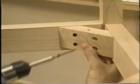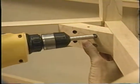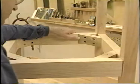I install the blocks with drywall screws. There's no need to pre-drill the rails, but the screws go in much more easily when they're lubricated with a little soap or wax.